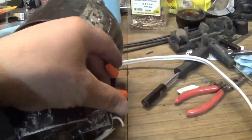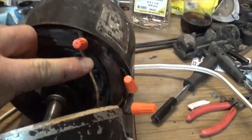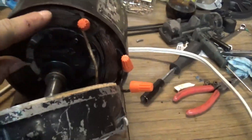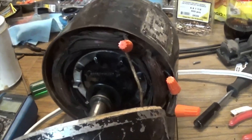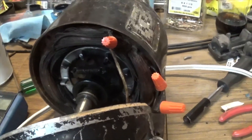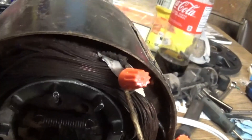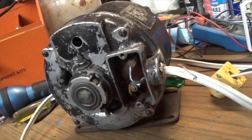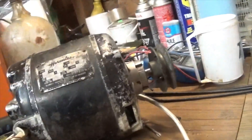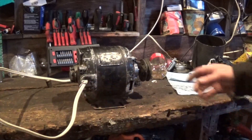Another thing - I could not get a resistance reading through the start winding, but I can get a resistance reading between the two white wires. So maybe the start winding actually burnt right out and opened up that last time I ran it. I'll put this neutral back in here and hook it up, and leave both the black wires - essentially the hot and neutral for the start winding - disconnected. No more start winding. Don't forget to put my wire-shorter-preventer 5000 back in there. If she doesn't run now she's going to get forgotten about for another 10 years probably.